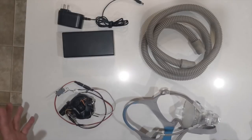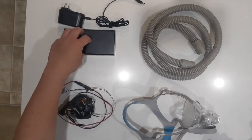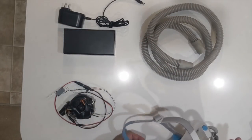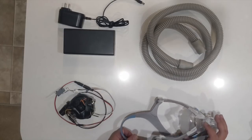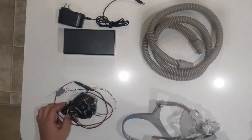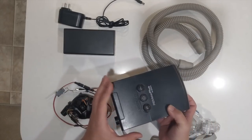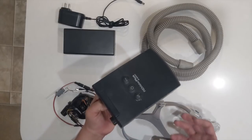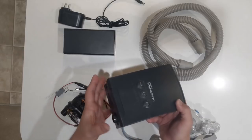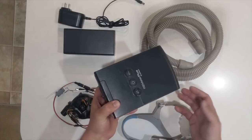This design is composed of four major components. We have the DC power supply, an optional 12 volt battery backup, a breathing tube, and a face mask from a CPAP. This is the blower that causes pressure to go into your lungs. CPAPs are devices for people who have sleep apnea — CPAP stands for continuous positive airway pressure — and what it does is blow air into your lungs so you don't accidentally stop breathing while you're asleep.